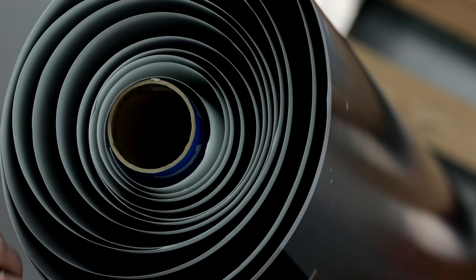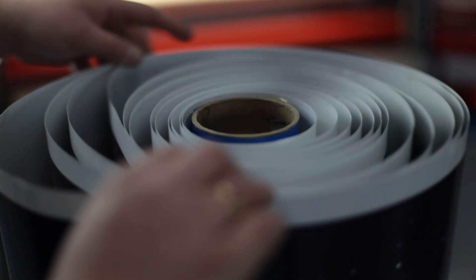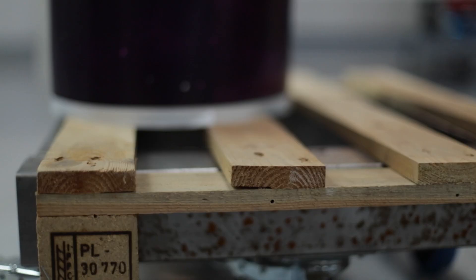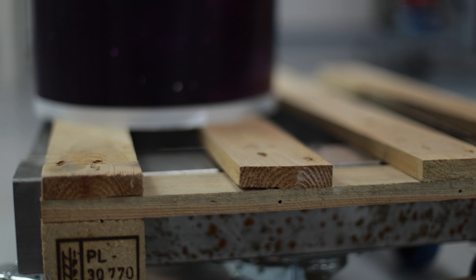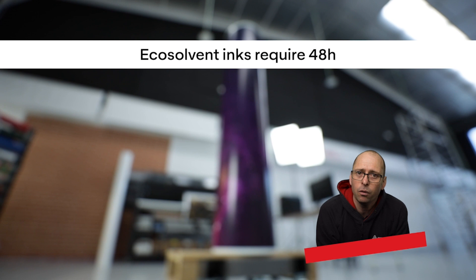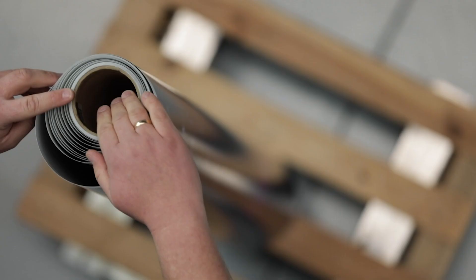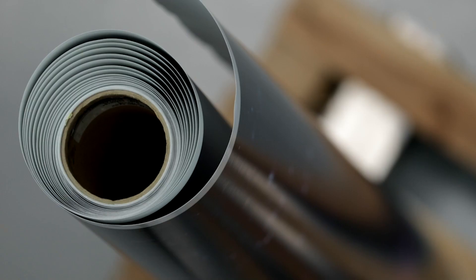Another technique, assuming you have a large clean ventilated space, is to hang the material from a support. Or, if you have limited space, you can use the loosely wound technique: loosely unwind the material roll creating sufficient space between the layers, and stand it vertically, making sure it is raised off the floor on a pallet. Drying takes time in the right conditions — allow at least 24 hours. Eco-solvent inks require 48 hours, but depending on the ink load and type of solvent, it can take up to 72 hours.